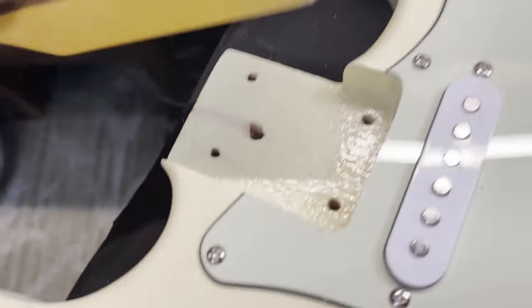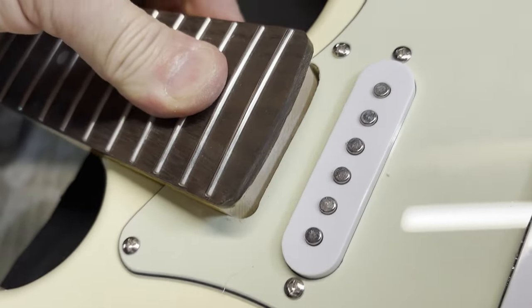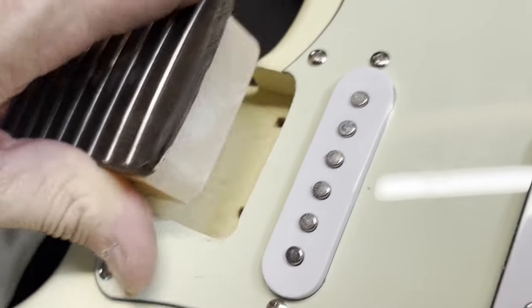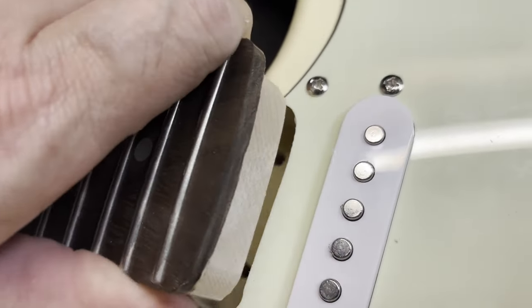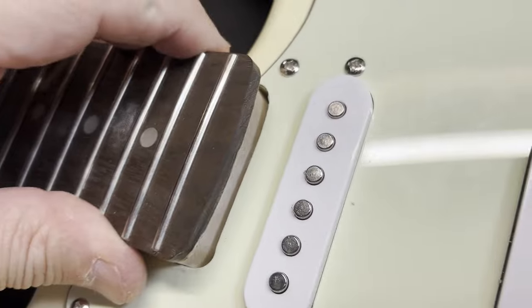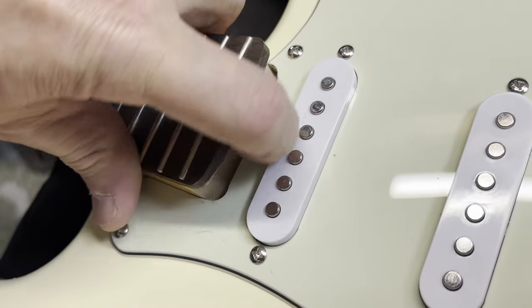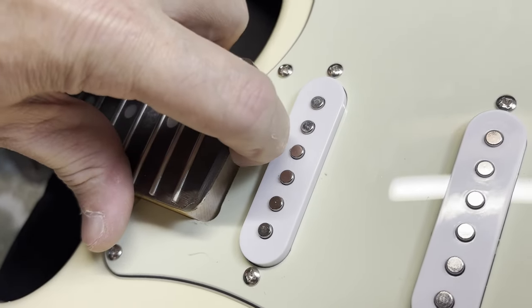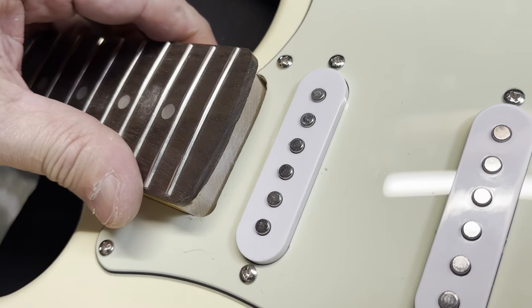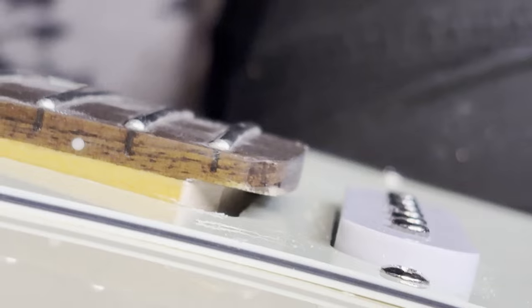So then watch this. When you put it in, where it fits, see the gap? So that's where it fits, but it doesn't actually fit tight into the neck pocket. So the screws are what's holding it out. There's no contact between the neck and the pocket, the back of the neck heel and the pocket. That's a good eighth of an inch, I would say. There you go, there you can see it good now. Here's a good eighth of an inch of space